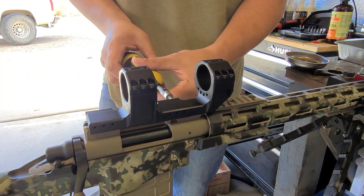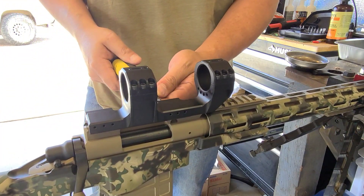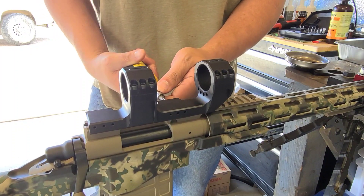The rail clamp screws use T25 and it's recommended to tighten in two stages. Tighten down in a criss-cross pattern starting from the middle bolt: first to 25 inch-pounds, then go back and tighten up to 50 inch-pounds.